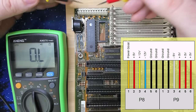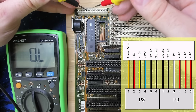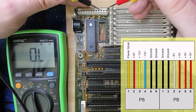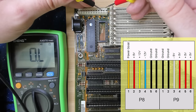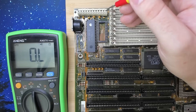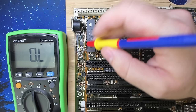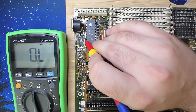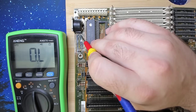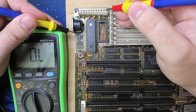In the middle here, this is all ground — they should all be connected together, I think these are four pins. And then we have something else on the other side. The three pins on the right side should be five volts, all three. So let's just see where this five volts goes to — it has to end up somewhere here, and you can see there's a plus for the battery. But there is no direct connectivity.